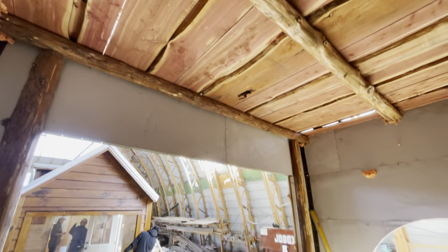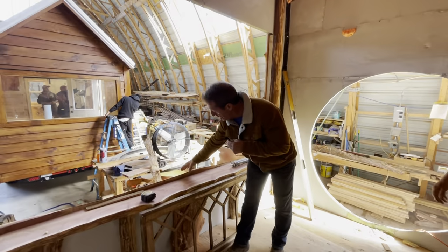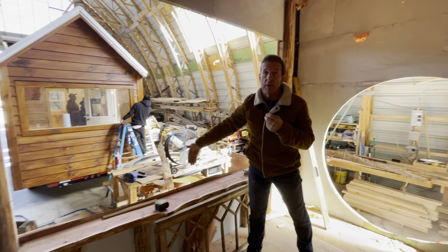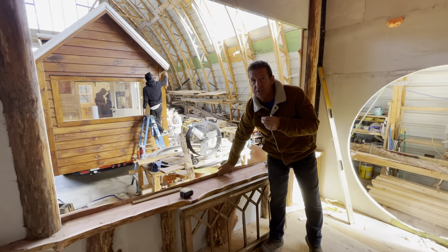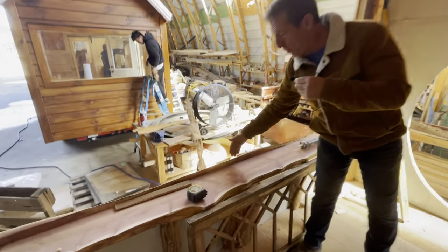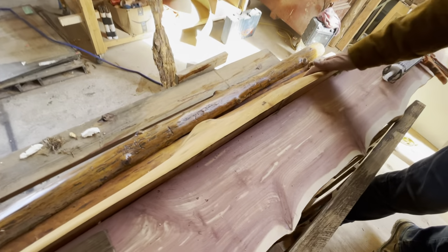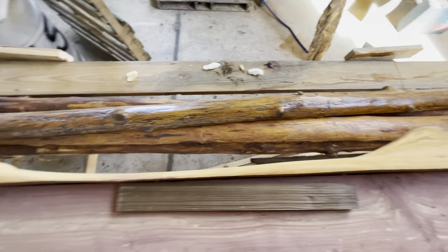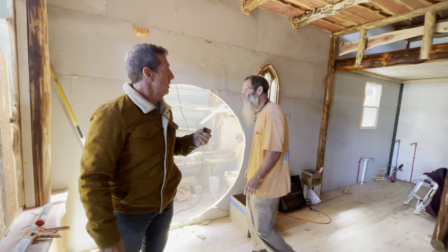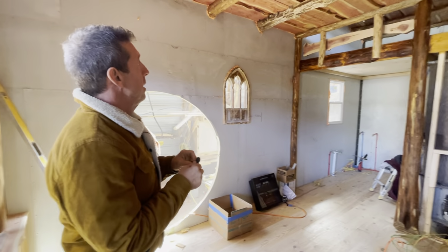Pretty cool. And what's neat is, this is the actual outside trim. So he'll do outside trim all the way around it. The glass will be set against that outside trim. And see how it's rounded? The water will just run right off of that. So we want to make sure this house can last for a long time without any water damage, for just a piece of glass up against it. You good? I'm good. Awesome.